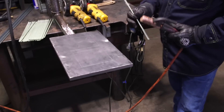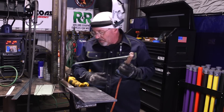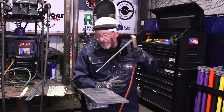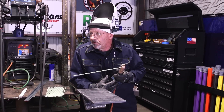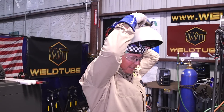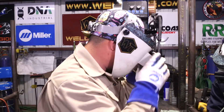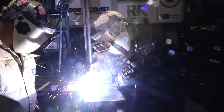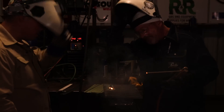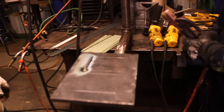Which one am I going on? Doesn't matter. So I don't want to run extreme angles — I just want to keep normal angles like I was running low hydrogen electrodes, 10 to 15 degrees drag. I can no longer see your scribe line. I want to turn the corner but I don't know where it's at. Oh, I came right to it. I was going to turn the corner and keep going. What's the re-strike — keep the rod going.